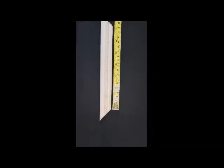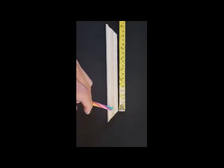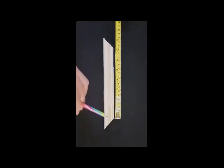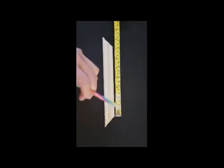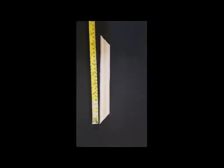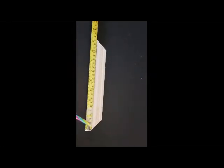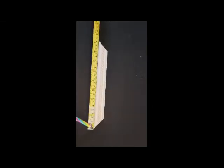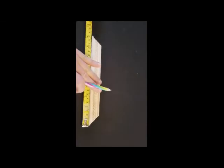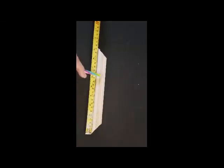Before you can truly measure your trim so you can mark and cut it, you need to first start with the angle. The first thing we did was cut this angle onto one side, then measured from the shorter end down to find our mark. The reason we used the shorter end is because that first thick piece of trim goes around the exterior of the mirror and needs to envelope it. For the thinner trim that fits inside the other trim, I measure from the long side down to make my mark — because anytime you measure for something sitting on the inside, you need to take the longest measurement into consideration. When it's on the exterior, it's the shortest.